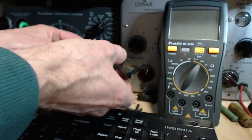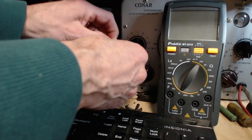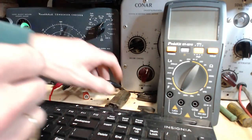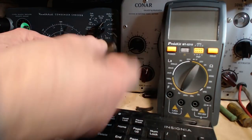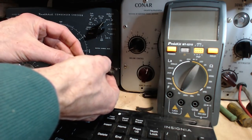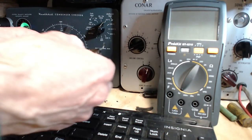Should we bother with the big one? Yeah, we've got to do the big one. These would drag down the performance of the radio just about anywhere they go. Okay, big guy — no surprise there. Can't even sustain 25 volts. These are raw junk piles. So what about this? This is the second one I took out. It's more similar to the first one at 150 volts — it's not opening all the way. Far from qualifying as good, that's for sure.